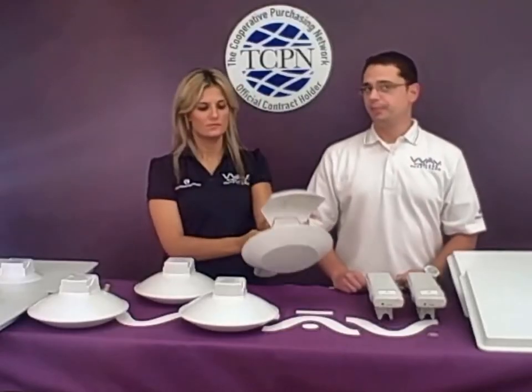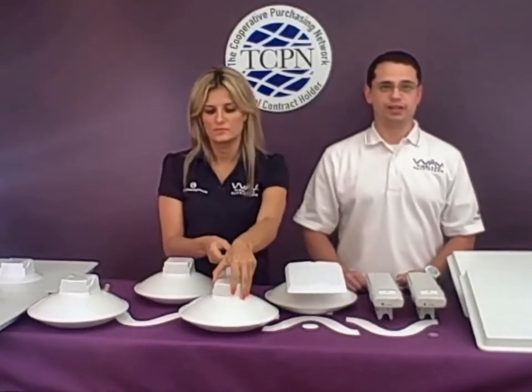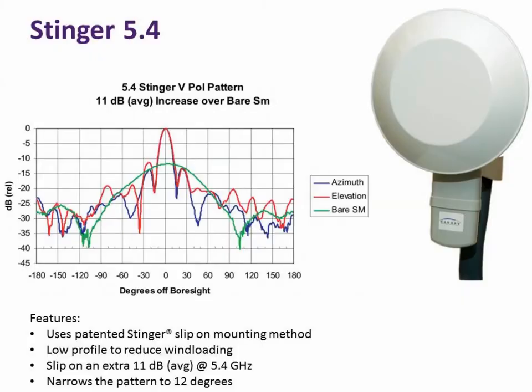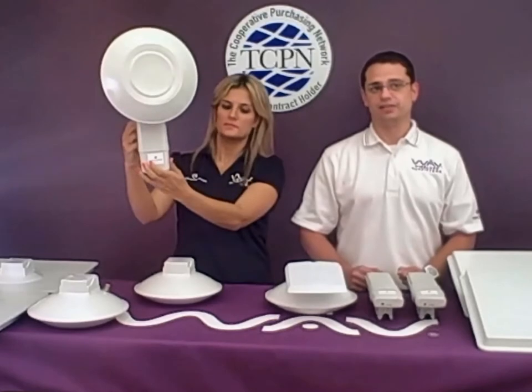The next one up is the stinger in the 5.4 frequency, giving you an increase of 11 dB and a very narrow beam width of 12 degrees. This will increase your range without having to use a reflector, and at the same time speed up your installs.